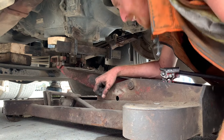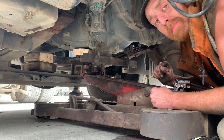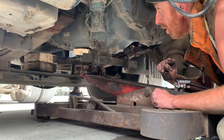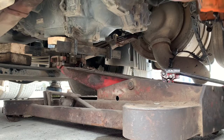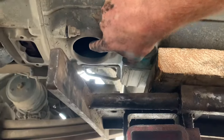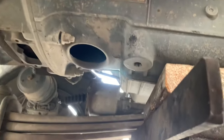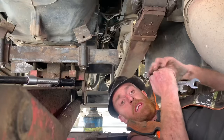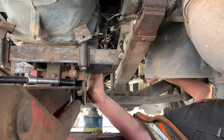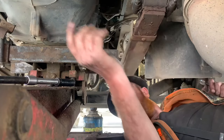That looks as safe as houses — and you may be thinking why I haven't chained it. It's simply because the only place it can fall is on the floor, which is where I want the thing anyway. Getting the bellhousing bolts off — I've made a boo-boo, I'm covering up the hatch so I've got to reposition it all. There we go, repositioned the jack so I can get into the bellhousing hole and release the clutch clip. There's always one bellhousing bolt you miss — always the most awkward one. There's the last bellhousing bolt.